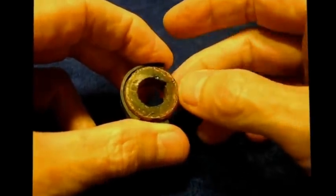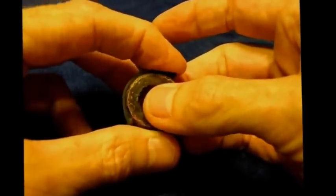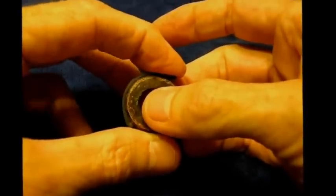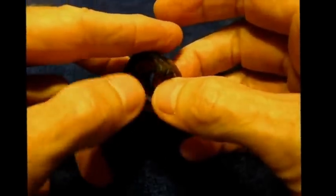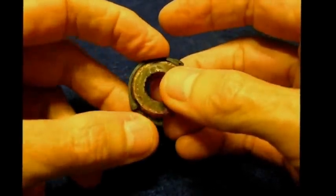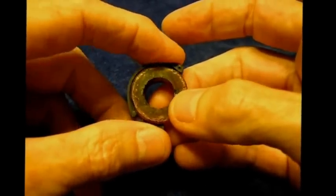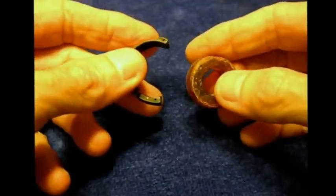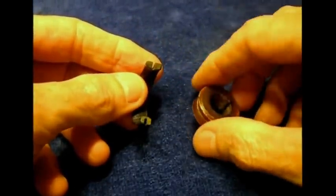So when the stylus vibrates, it makes this rotating wheel tend to grab the shoe, which tends to pull on the diaphragm and then release on the diaphragm, and that produces the vibrations. These machines were notoriously finicky, and after a year or so, most of them didn't play. None of them play today unless they've had some very careful work done. This is the only one in the world that I know of where all new parts were made. I did this 25 years ago, and it works just fine today.